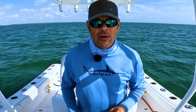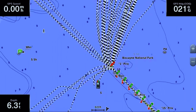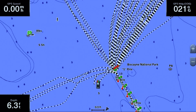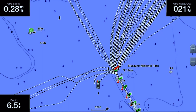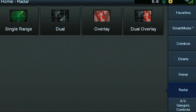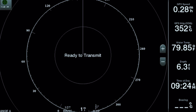Let's jump in and show you how to power up the radar. We're on our navigation chart on screen. To find your traditional radar image, hit home, and all the options will pop up on your right-hand side — click the one that says radar. Once you connect the radar, this will automatically appear on your screens. We'll press radar, then select single range for this tutorial. Your black radar image pops up and tells you it is ready to transmit.